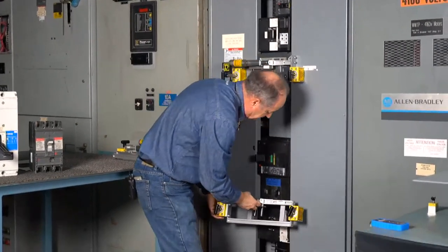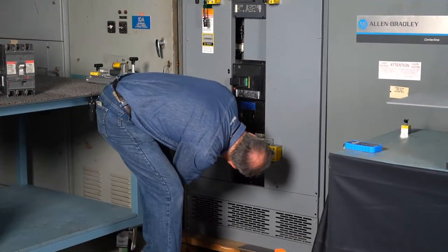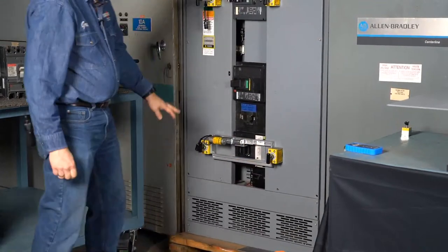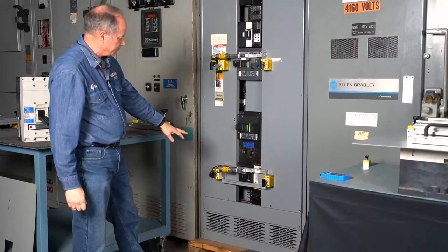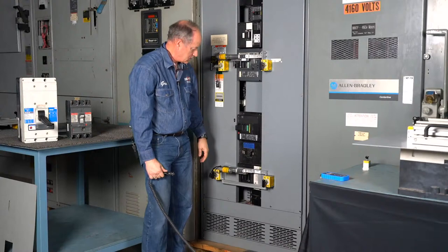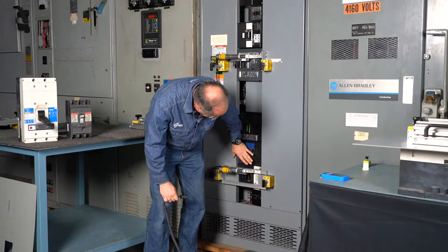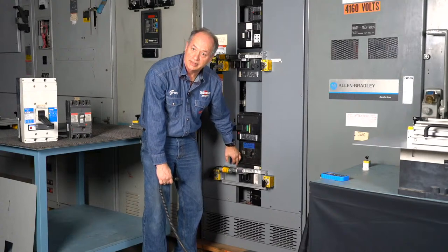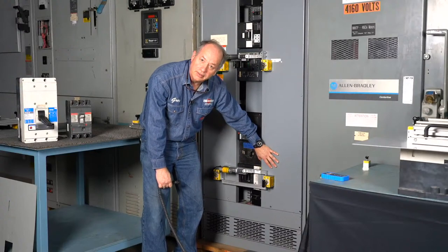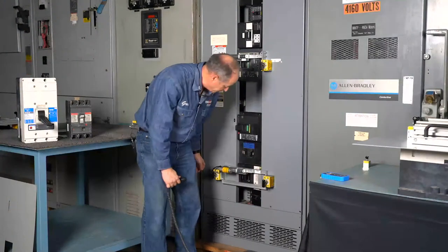All right. This is the RSA 57G, and it's for the Square D L frames. Normally we would locate on the raised housing, but we can't here. The reason we can't locate on the raised housing, which would normally be in this area, is because this breaker is recessed about a half an inch in terms of its mounting. So we have to use the actual sides of the frame itself, the switchgear, to resist the movement going back and forth on this one.